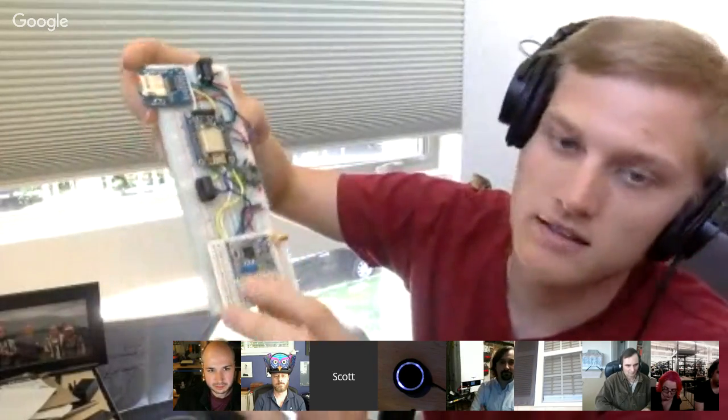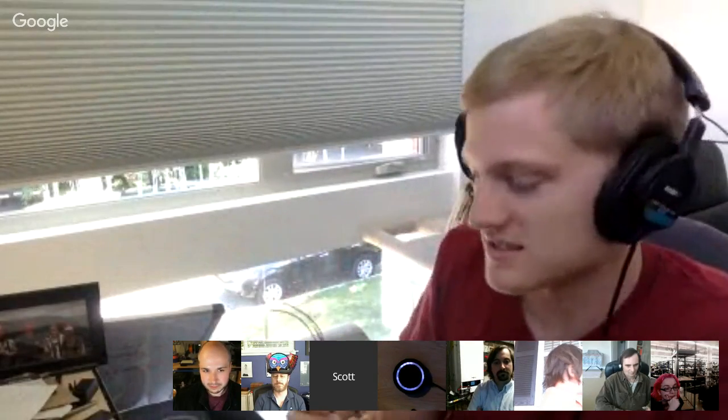So this is the old Huzzah board from you guys with the ESP8266, a micro SD breakout, and at the bottom here is the video receiver that I got from Banggood. You actually have to open the shell up and remove a resistor so it talks SPI. So I did that, and that worked reasonably well. I did some tests with the micro SD card and managed to do some analysis and get within a second. It's definitely not perfect.